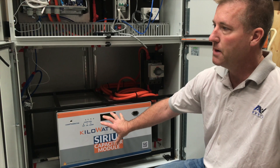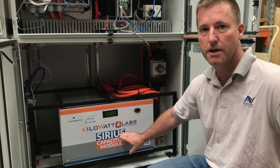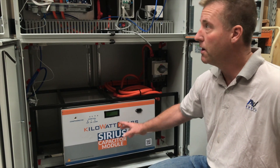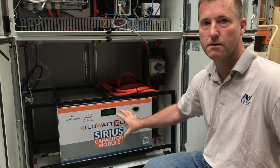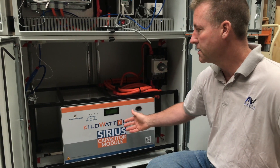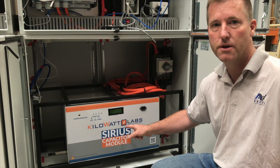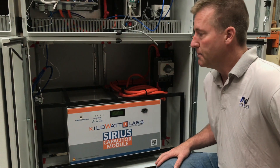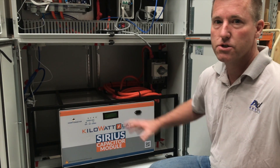The most amazing thing is that one supercap here is 7.1kWh and it has enough peaking power to run all three inverters. With a lithium-ion battery you could never do that — it would wreck the battery and trip. But here we can get this supercap to surge up to about 40kW DC output to feed all three inverters. So basically the whole system can run off one supercap, but we're putting three in because we need more energy storage.